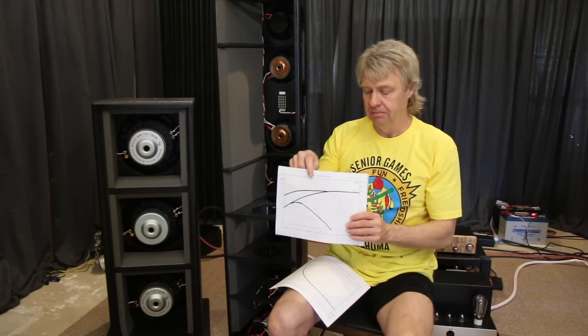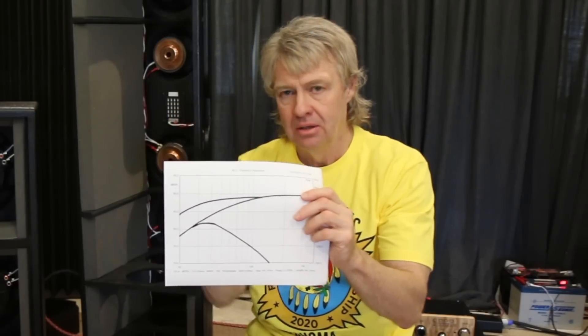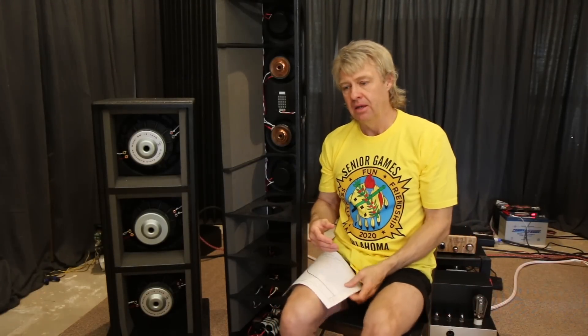Here's another approach. One curve is one woofer, and the second woofer has a large inductor placed on it. When you put a large inductor on the lower woofer, you're basically saying we're still going to let it play the very bottom end, but as it approaches the higher frequency ranges, we're just going to roll all that off — limiting it to just that lower frequency range. It doesn't have much output down low on its own, no more than the single driver did. But when you add those two together, you're gaining as much as 6 dB at the bottom because you have two of them paralleled at the bottom. As you approach the higher frequency range, you don't gain as much output, and right at the crossover point they sum back to the same output as a single woofer. That's a way of increasing that bottom end.